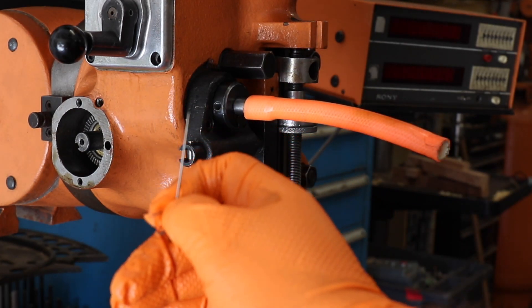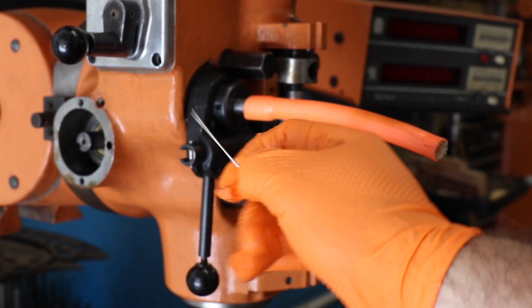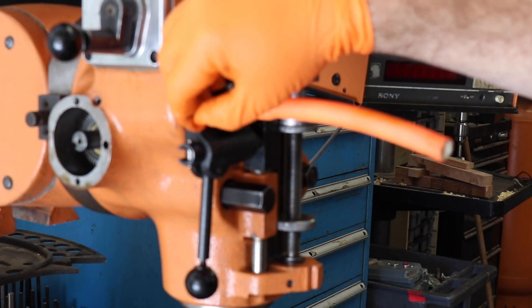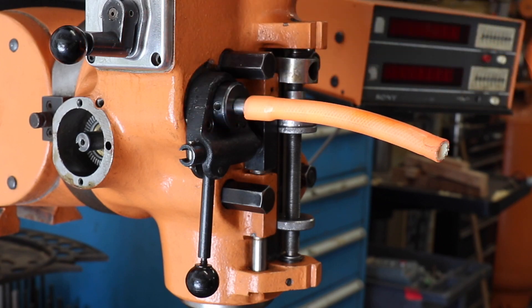What I had to do was spray some WD-40 and PB Blaster into the rod and let it sit overnight. Then the next day I got a little help from my wife — she used a needle to dig around the ball bearing and try to loosen up some of the grit and the gunk while I blasted air through the hose. It ended up working and the bearing shot across the garage.